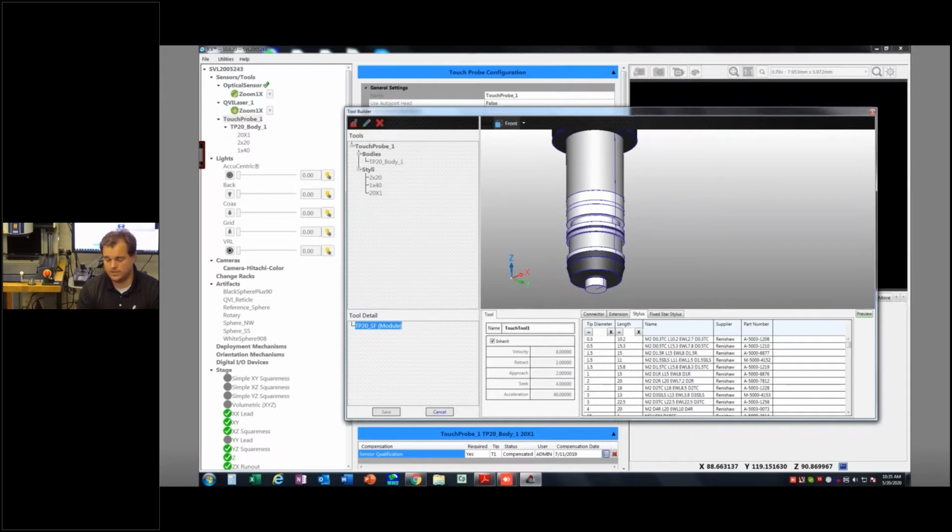And then there's also the consideration that there are times when a part is more of a CMM part for those types of reasons. If it's stuff that needs to be probed all over these different work planes and different axes, that's usually an indication that maybe it's better suited for a CMM. But that said, we have plenty of probing capability in here. So let's go ahead and build our first probe.